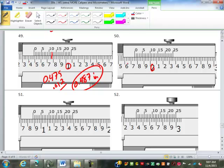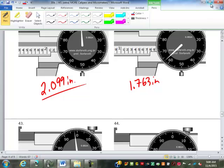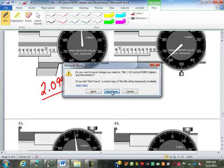Now here's the 2. So this is 1 whole inch, because we're not to the 2 yet. 1.750. And then what lines up here looks like this one, the 6. So 0.006. So 1.756. Oops, that's not millimeters, that's inches. What do you think? Vernier scales are a pain in the butt? Yep. Okay. Well, good news is I got a packet for you.